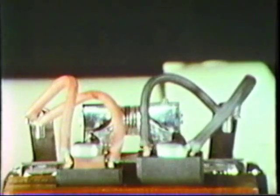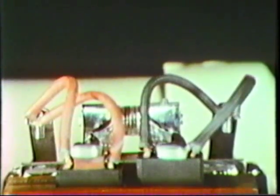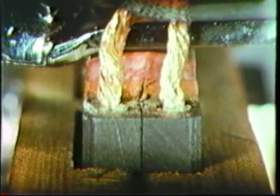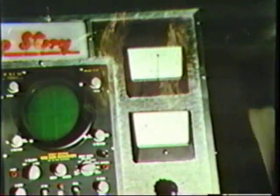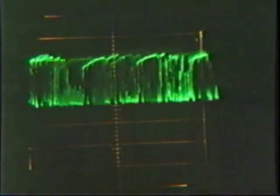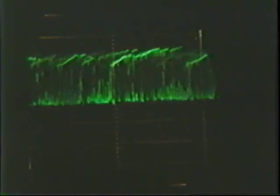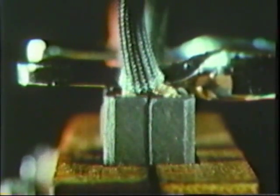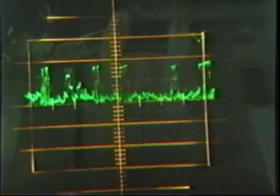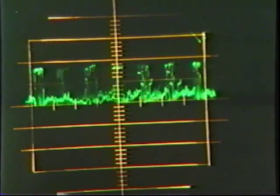There is much less movement of the red top brush and the spring finger on the left. With the red top pad, very little disturbance can be detected because of the dampening effect of the rubber. 2.8 volts are required to force 2 amperes through the plain brush. The trace is very erratic and indicates voltage which is open circuit 50% of the time. Only 1.4 volts are needed to force 2 amperes through the red top brush, a 50% improvement in efficiency of brush contact.